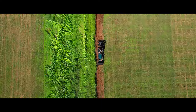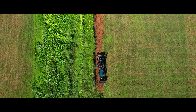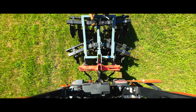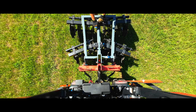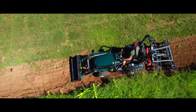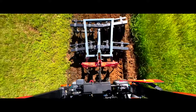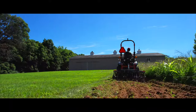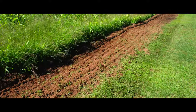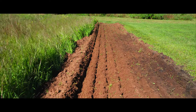This is a good example of when you can use different size tools on a tractor. I was using a four-foot disc, which is really the right size disc for this machine, but I'm using a 72-inch landscape rake — they're just a different tool. A disc is ground-engaging, puts a lot of resistance and strain on the tractor and engine. Whereas a rake is really just riding along the surface and you're not digging down into the soil. And the reason why on something like a landscape rake it's good to go wider is because sometimes you're going to run it at an angle — you can pitch or angle them left or right. When you do so, just like a front plow blade, it's going to narrow up the overall width. So you want something a bit wider so that if you do narrow it, it's still covering your tire tracks.